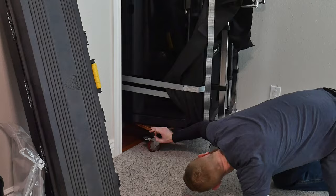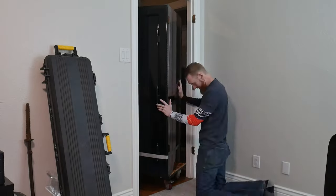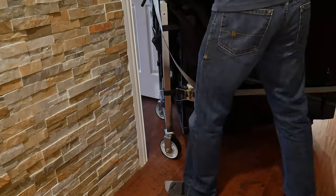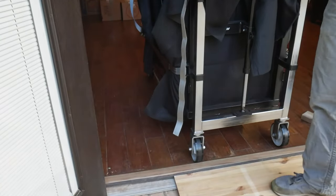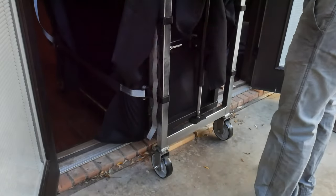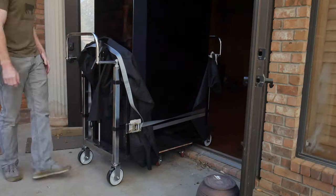Now I said this was a method for moving a safe on your own; however, I did employ my wife to help make this turn and not damage any walls. After making the first turn out of the room, the rest of the process was fairly easy, but a little time intensive. Don't assume that you can simply roll this heavy monster over a threshold unless it's a very small threshold or you have a low profile ramp. I solved this problem using a stepover method with the new furniture dolly. Push the safe up to the threshold until the front 6-inch wheels on the hydraulic mover contact it, then place the 4-way furniture dolly under the center of the safe and allow the safe's weight onto the dolly. Keep the weight on the rear hydraulic mover, raise the front mover, use a welding clamp to hold the wheels up, and push them over the threshold. Once you're over, lower the wheels and lift the safe off the 4-way dolly, then roll the rear wheels up to the threshold and repeat.